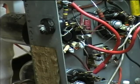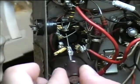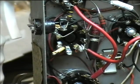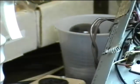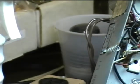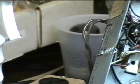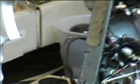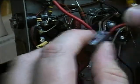But now what I need to find is a circuit ground point that I can connect to, and I think that one exists. Looks like one exists up here. So let's see if I can put on this cap, or I may be able to even find another place in the circuit to mount the cap. I'm just looking to see where the best mounting place would be. You don't want to ground it to the chassis. It needs to be grounded to the circuit ground, because for safety reasons that's isolated from the chassis.